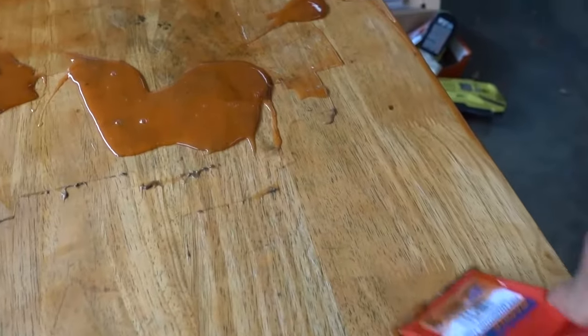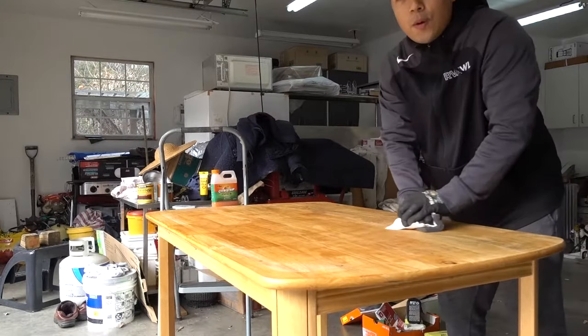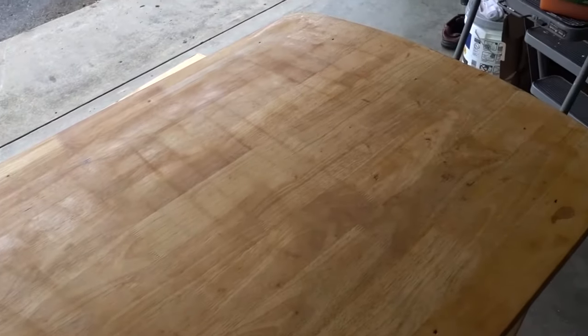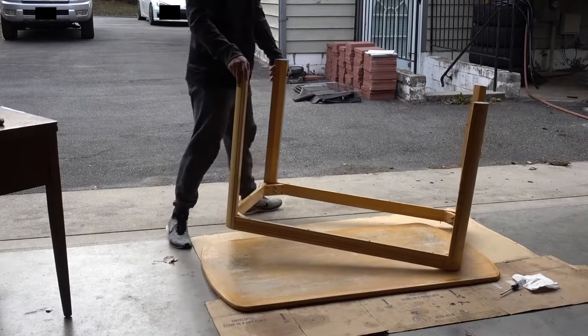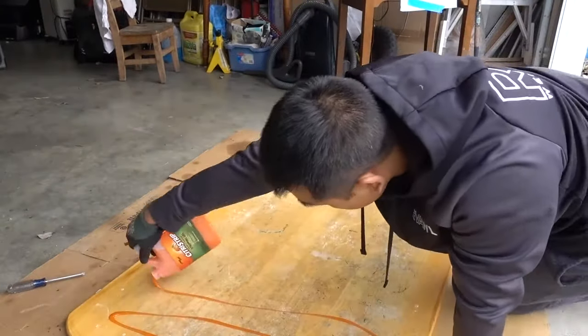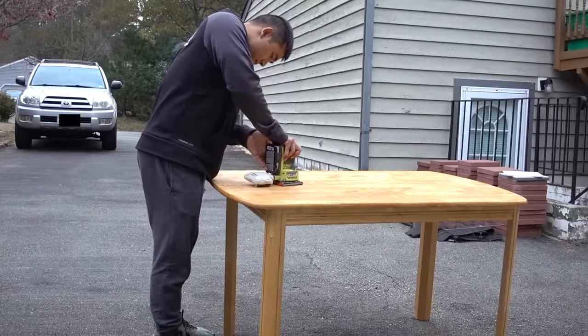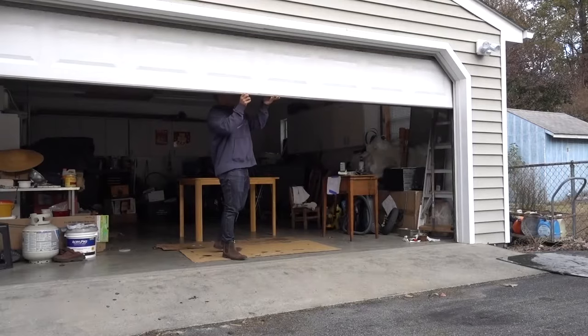Here's just a quick time lapse. After everything's been scraped off, you can see that there's some remaining residue that's been soaked into the wood. This stuff is really difficult to manage because it just becomes goop. Here I'm using the scouring pad to get stuff I can't get with the putty knife — you can see it just picks everything up. Now that everything's been taken off, I took off the legs and wanted to do the other side, because my girlfriend's parents actually flipped over the table after it had been worn down so much. So both sides of this table are completely destroyed. I attempted to start using the sanding power tool, but I quickly decided it wasn't going to happen because it was still wet from the citrus strip.